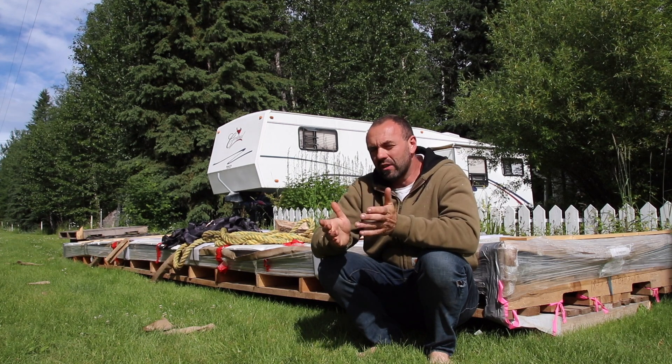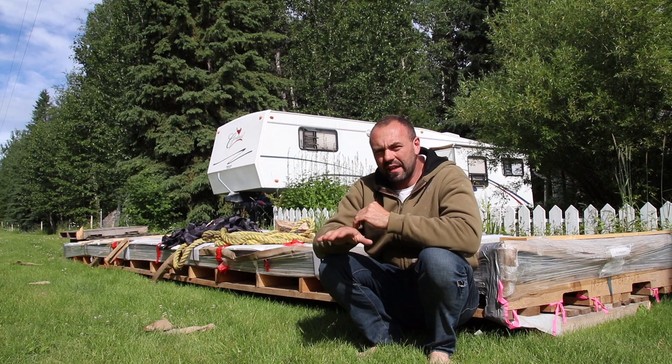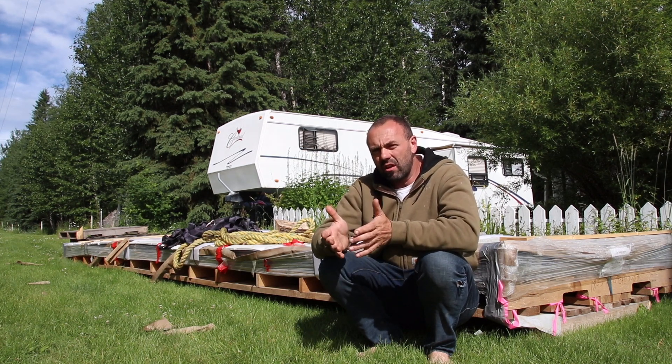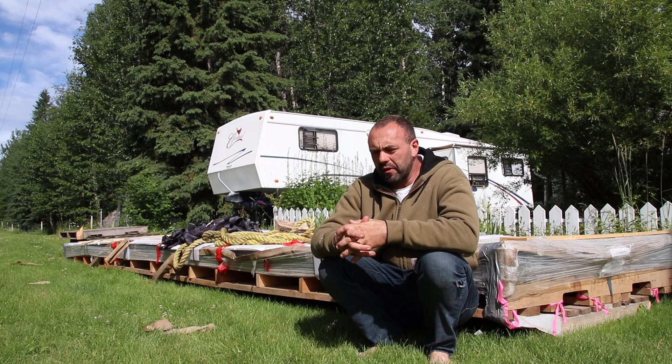You're probably wondering why I didn't go with solar wrap. Truthfully, I like the rigid glazing a little bit more because I don't like the idea of it flapping around in the wind. I like the idea of having something solid that, when snow lands on it, it's going to shed off. And so that's why I chose polycarbonate.